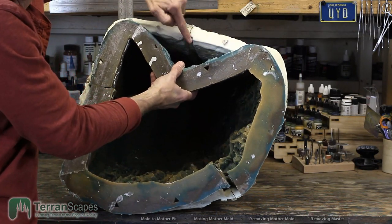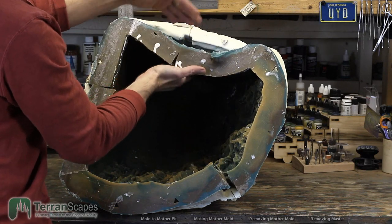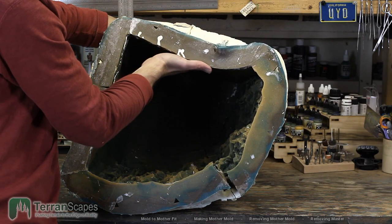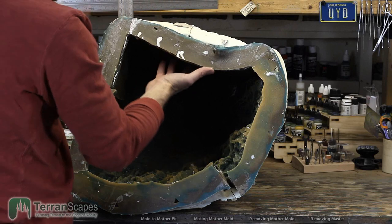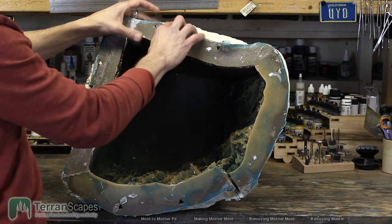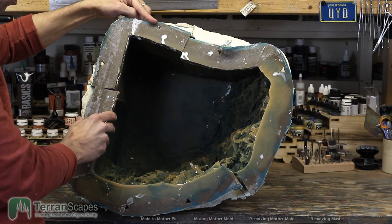you should be able to see this groove to receive the tongue, so to speak, the tongue and groove system. I can't just press it in. I have to leave the seam loose, push it into that groove, then screw down all of the retaining screws to close that in. So it takes a second to line everything up and then attach it all. But you can also see how the peg system works. Here's one. So once this is in tight, the mold snaps over these spots, and I found that really helps to hold them in place quite well.